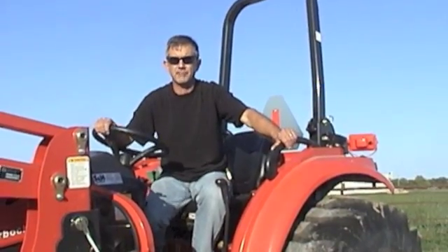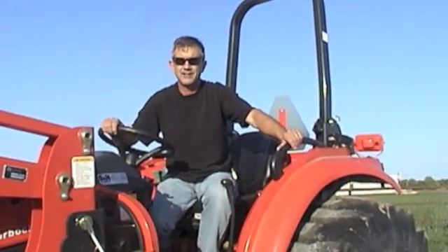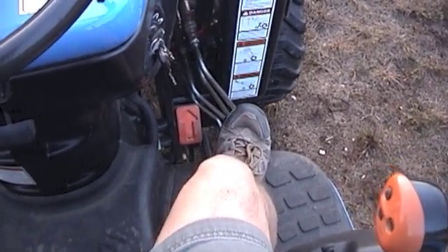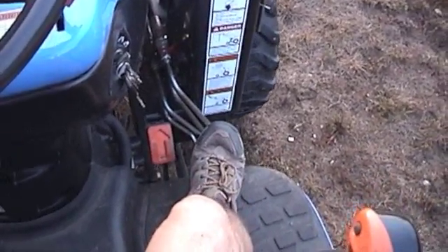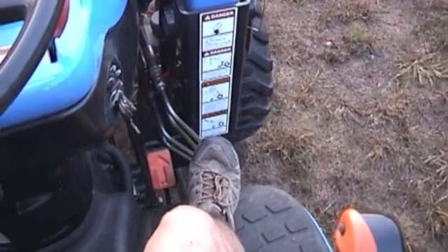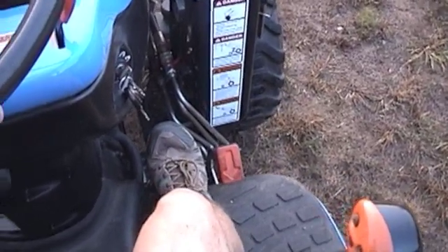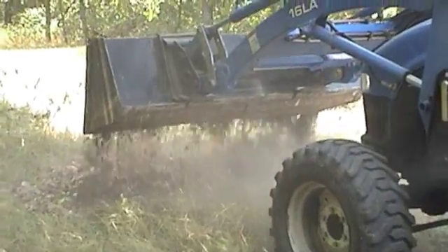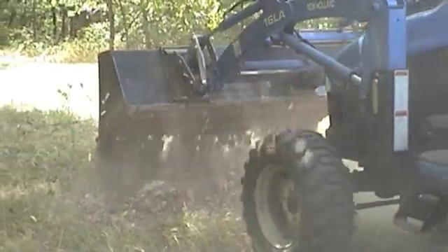The final transmission I'd like to talk about today is hydrostatic. Hydrostatic transmissions are wonderful. You push a lever down and either rock it back and forth, or you have two pedals — one for forward and one for reverse. You go back and forward at any speed at any time. Hydros are great if you're using a loader. I have a hydro on my tractor; I use it for loader work all the time and I love it. They're great transmissions.